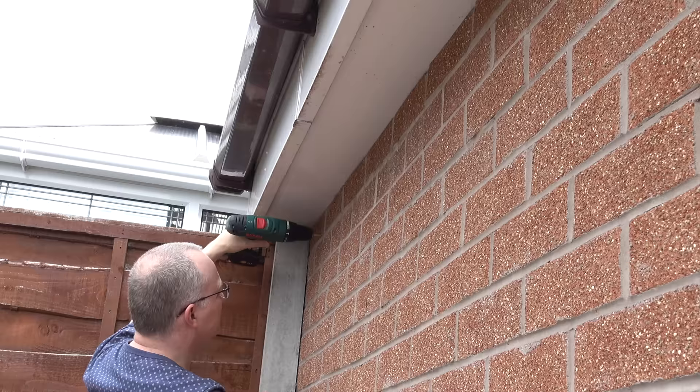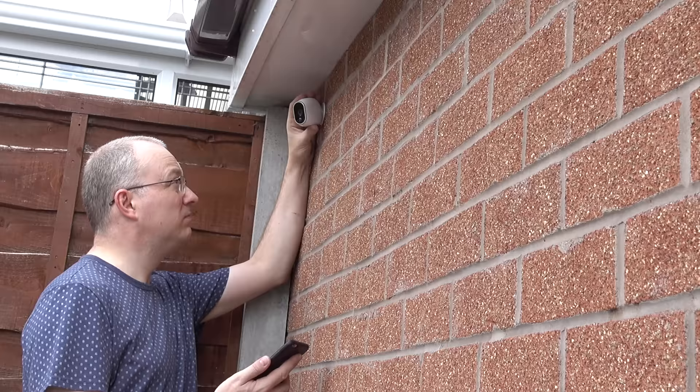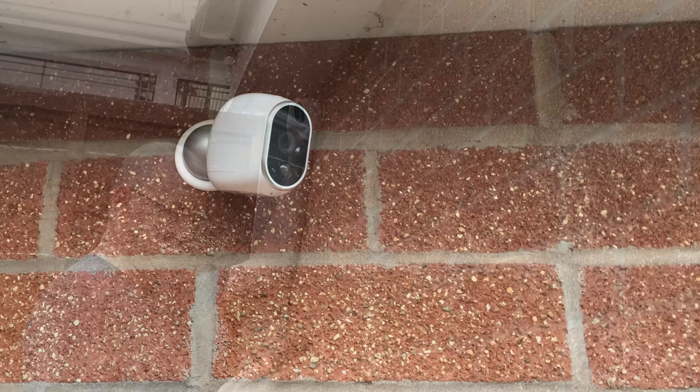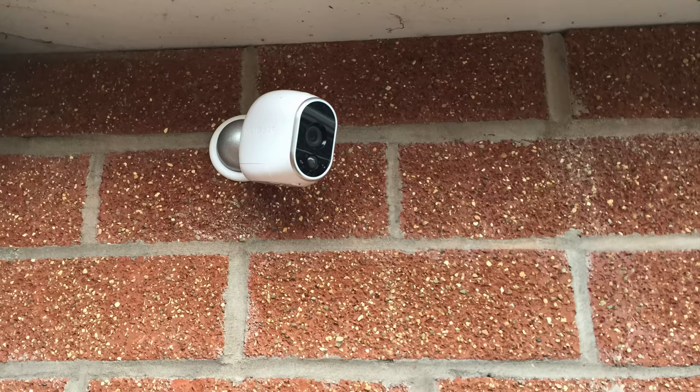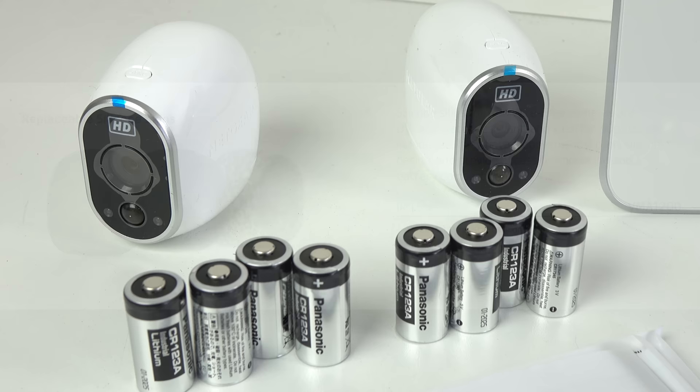To install: first, drill a hole in the wall — I think it was six and a half millimeters. Put the plastic plug in, then put the screw in, leaving a little bit of room so you can put the dome on top. Hold it firmly against the wall, then just put the camera onto the dome. Activate positioning mode in the app — that lets you see what the camera sees with less delay, so you can get the camera position exactly how you want it. If you're concerned that those white cameras are a little bit too noticeable on the wall, you can get silicon skins for them to help them blend in a little bit better.